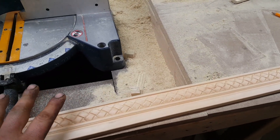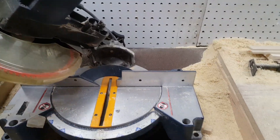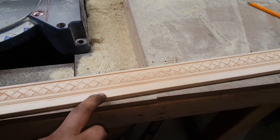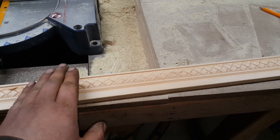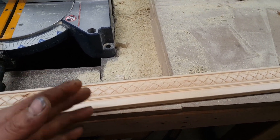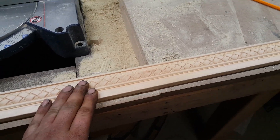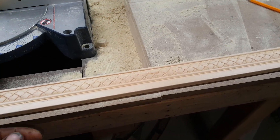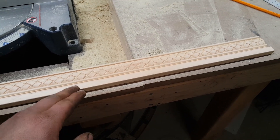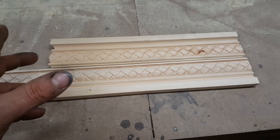For anyone who hasn't wrapped molding around something before: we want to cut a 45-degree angle, which is what I have my miter set up for. Remember that the measurement you take is the inside diameter because at an angle the outside diameter will be slightly larger. So we need to pay attention to which side we're cutting. Since I'm using scrap leftover from the other pieces, I'll cut one of the side pieces first, make sure it's right, and then replicate that three more times. I got the first one cut, matched it up in the house, and it fits perfectly.